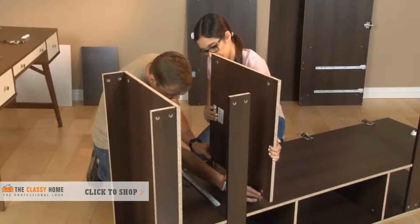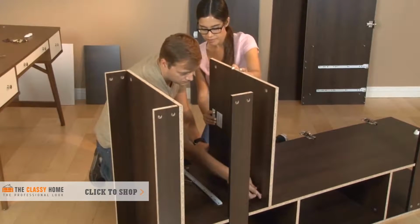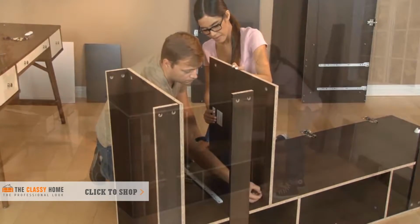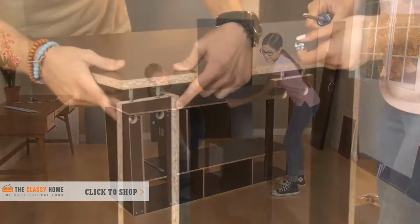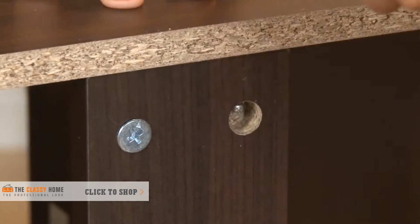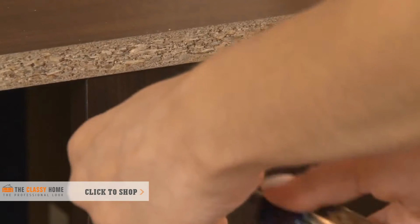Now, attach the horizontal wardrobe divider to the middle wardrobe piece over the capture bolts and secure it in place using the capture nuts. Carefully lift the left wardrobe panel atop the wardrobe bottom, back braces, and horizontal divider, slide it into place over the capture bolts, and once again secure the panel with the round capture nuts.